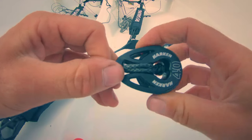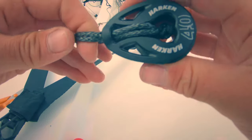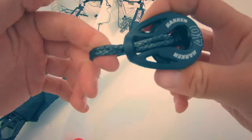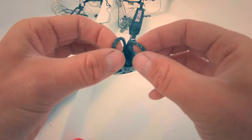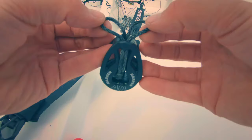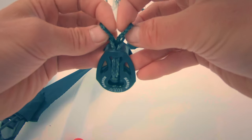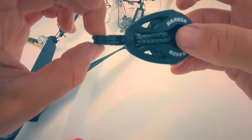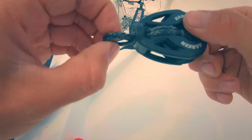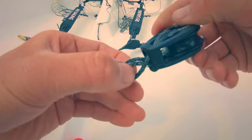Put the soft shackle around the block in a simple loop. The critical part is to flip this soft shackle into a figure of eight — pull the two loops out the bottom of the block and twist them inside out, forming the figure of eight. If you don't follow this method then the strops will pull apart your block.